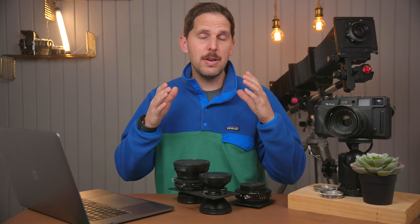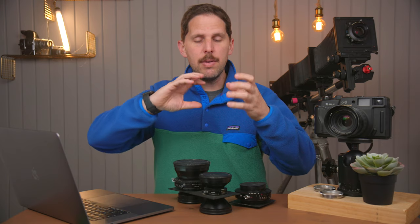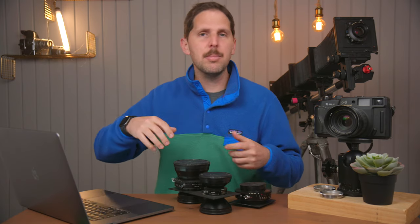They used to sell those etchings as spares but not any longer. Sometimes lenses used to be shimmed by the manufacturer, meaning the front and back element without anything in between would not be perfectly calibrated to be in focus at infinity to the manufacturer's tolerances. So the manufacturer would assemble it in the factory with a special machine — probably a collimator — and if it needed adjustment, would shim it with something like 0.01mm shims. So instead of 150mm it might need to be 150.01mm to be calibrated properly.